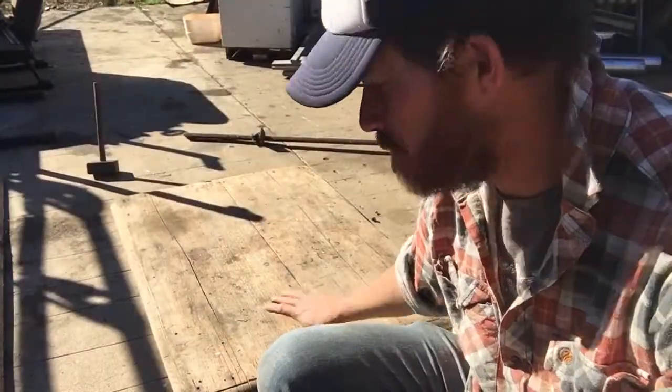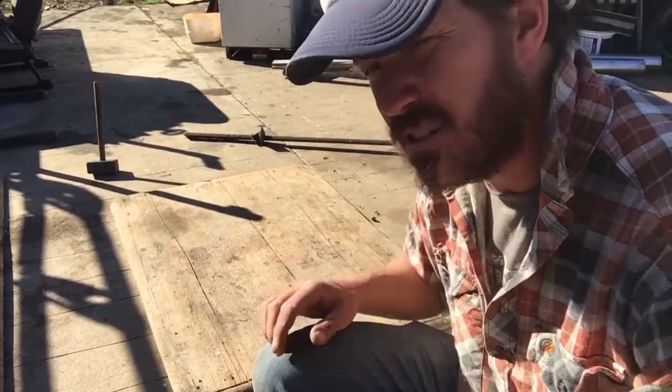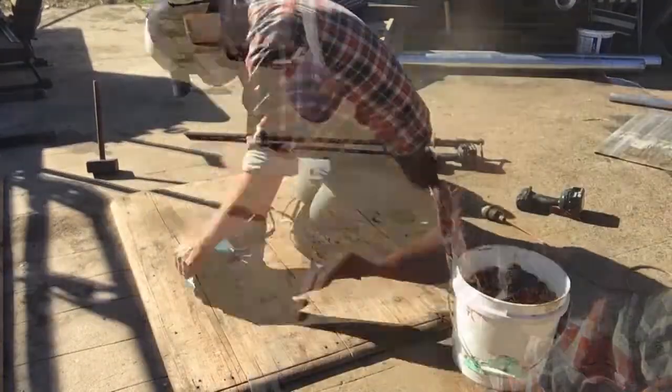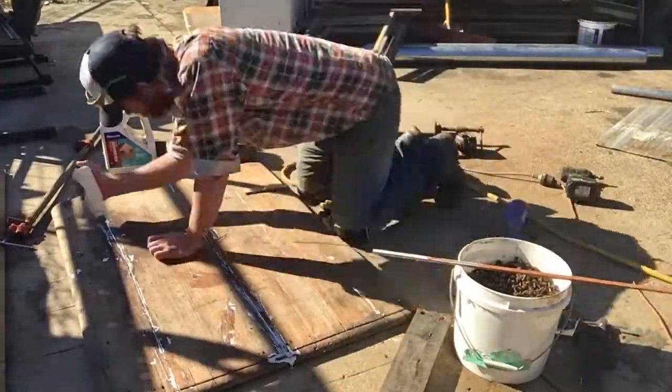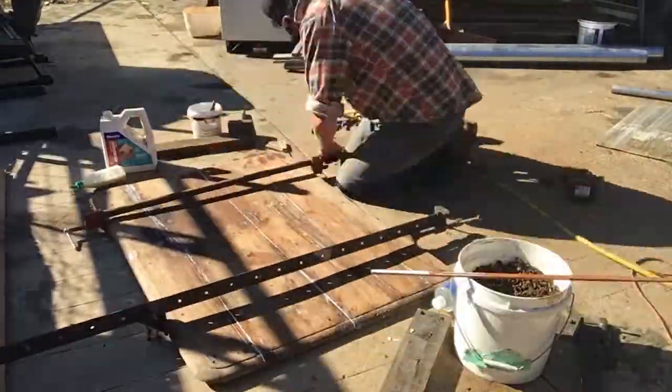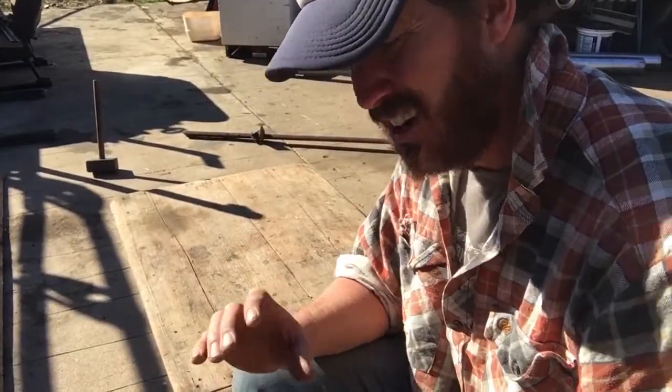I've just done the bottom, I've flipped it over, and what I'm going to do is give it a quick sand and then go along and fill all of these cracks with some glue and just hold it together. If you're doing this properly, you would go to the effort of biscuit joining and getting it all really nice and straight. This table's literally come from the burn pile, and I've got to get it together in a couple of hours, so that's how I'm going about it.